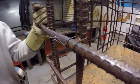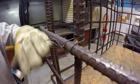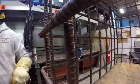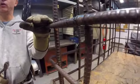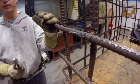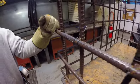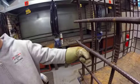So you can see here we have a standard saddle tie. The nice thing about the saddle tie is it supports that horizontal bar on the vertical by having wire both on the top and the bottom. So it's very secure, used in situations like a wall, or maybe if we're tying stirrups to a column or a beam where we have multiple points of contact and want to make sure it's nice and tight.